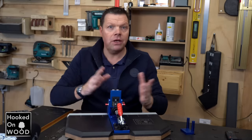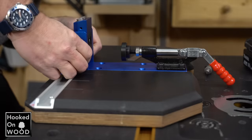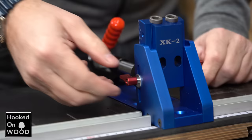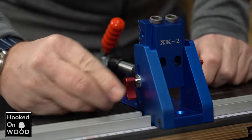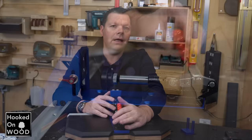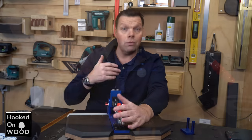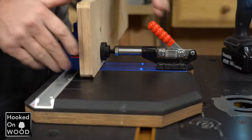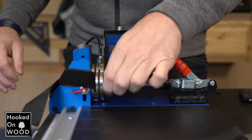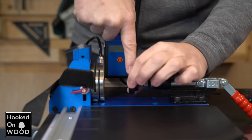This pocket hole jig is very easy to use and it feels great. The knobs to adjust the height are pleasant to work with, and if you tighten the knob and it ends up in the way of the wood you need to clamp, you can quickly put it out of the way. The clamping mechanism feels sturdy and it has a firm foot at the end. It clamps really well, and you feel this when you work with it — it feels very sturdy. Because it felt so comfortable, I wanted to measure the clamping force. When you place the foot against the piece of wood and only turn it half a turn, it creates a force of 75 kg.